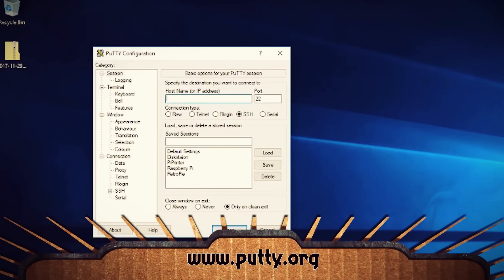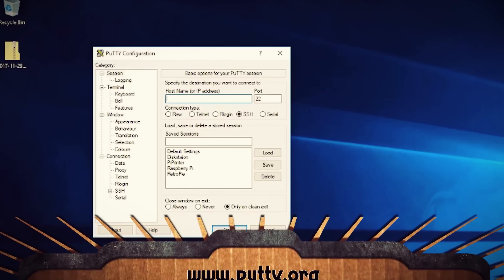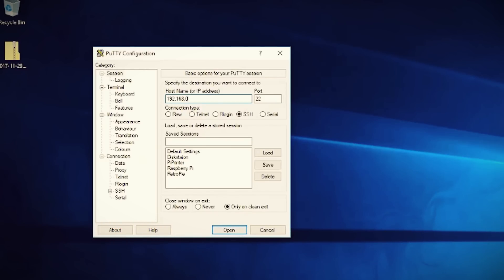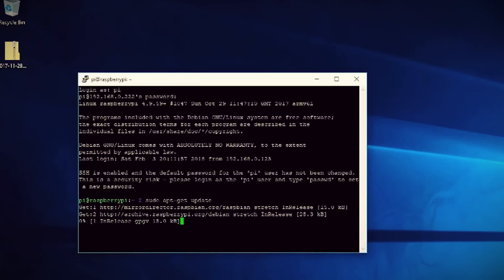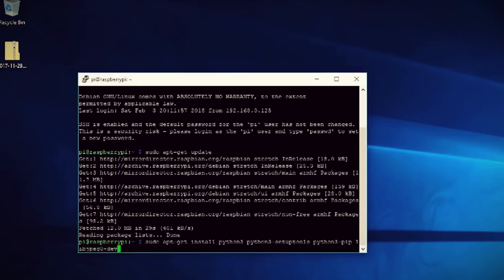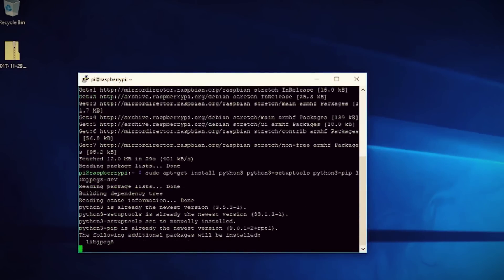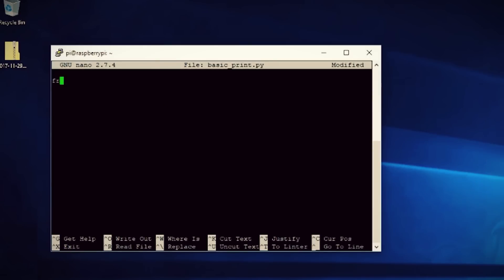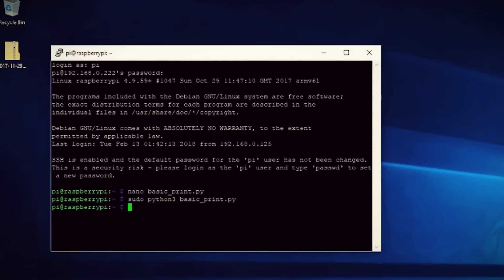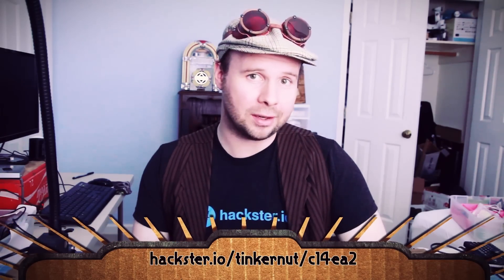On Windows, to connect to the Raspberry Pi you're going to need an SSH client. I'm going to be using one called PuTTY. Once you have that installed, type in the Pi's IP address and then click Load. Log in with the default Raspberry Pi username and password and then update the Raspbian operating system. Now we're going to need to make sure that Python is installed properly, and then we can install the ESCPOS printer library. From here, let's write a quick little Python script to give it a test, then plug our receipt printer in and run the script to see if it works. You can find more information about this script as well as the parts I use at the project page on hackster.io.